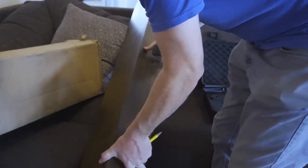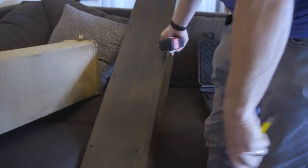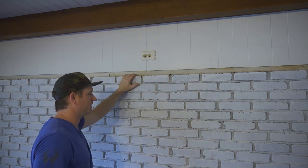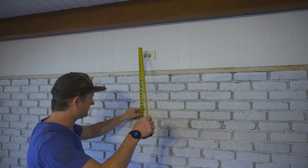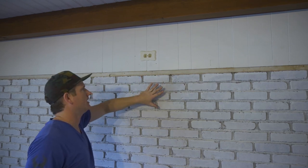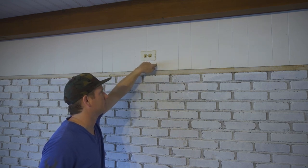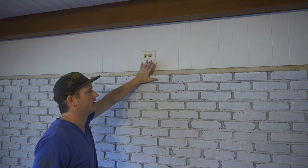When it comes to the mantle, it's just over five inches in height. We have 51 inches of height on the wall, and the mantle is going to sit about 16 inches up, leaving about 34 inches with a 25-inch TV — so nine inches remaining, trying to do about four or five inches on the top and bottom. To fit the TV in that range, we're dealing with brick below and wood backing above. We're going to use a two-by-four to sit in this area to make it flat, with bolts going through into the wall wood, and the bottom attached to the brick.